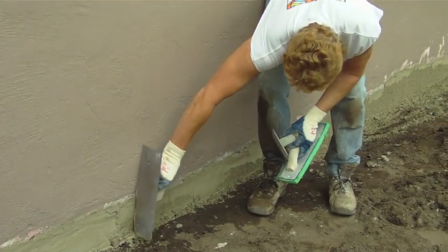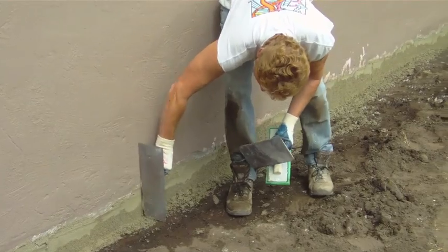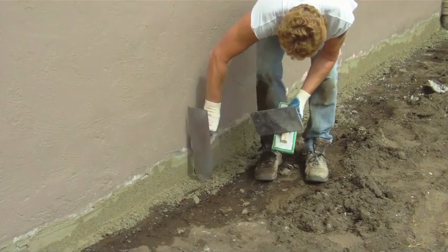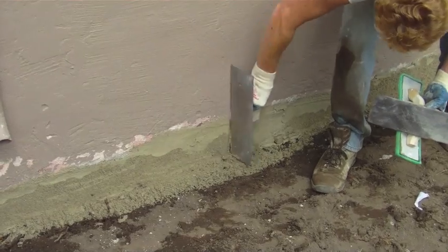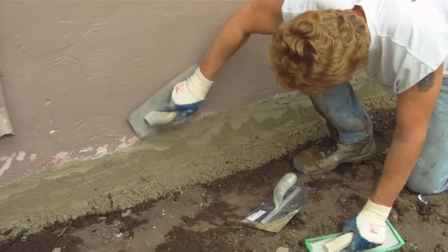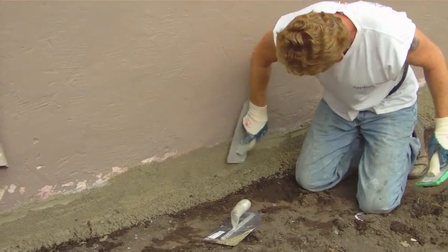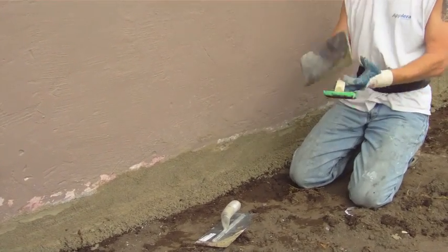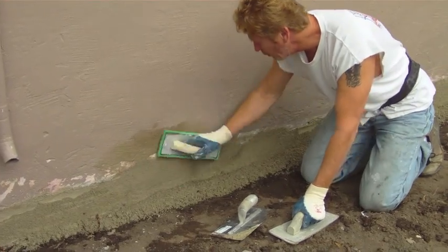What I'm doing here is I've pyramided these bottoms — meaning just like a pyramid, so I can scrape back, because I have to get this wall true and plumb for my texture. After we get a good plumb, I'm going to use this hard rubber float — it gets the joint real well in here. After we get the joint, I wet this sponge float, and coming upward like this I will be ready to do my texture.